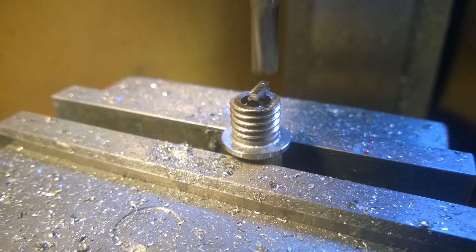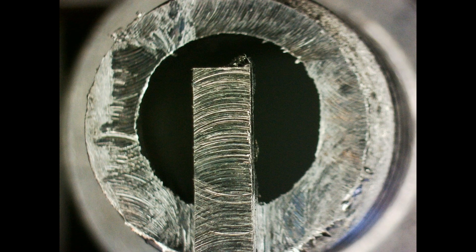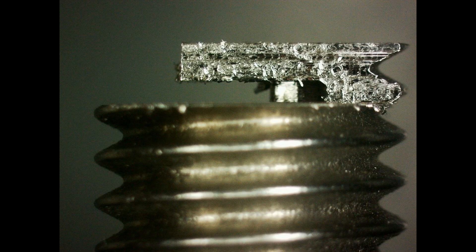When you mill down far enough you end up breaking through, which is what you can see there. There's a close-up showing what's broken through. What we're left with now is an electrode arm. It looks like it's off-center but that's just the burr on the inside — once you see it cleaned up you'll see it's basically centralized. The electrode has to extend beyond the center. From the side profile you can see how deep the plunge cut goes and how much electrode arm is hanging over.